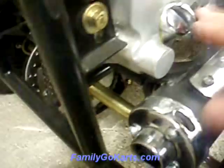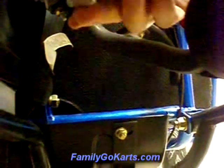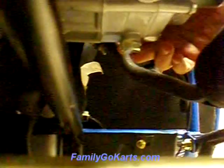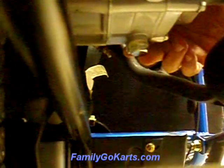We're going to put this back on here and tighten that up. That's where the dipstick. Now when you change the oil, you're going to remove that. But underneath the engine — this here is your drain plug, right there. That's your drain plug where my finger's pointing. That's a 17mm bolt. You remove that to drain it.